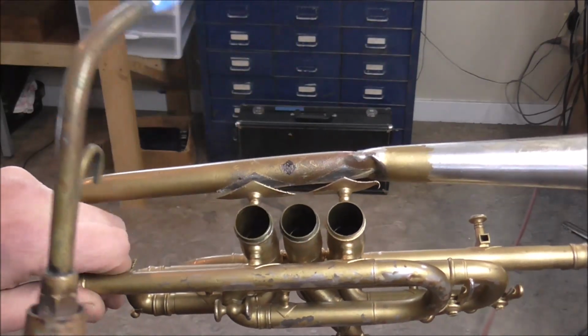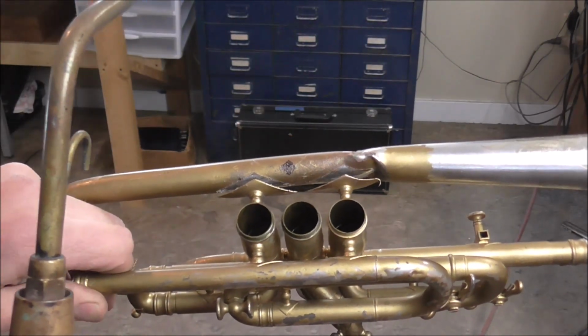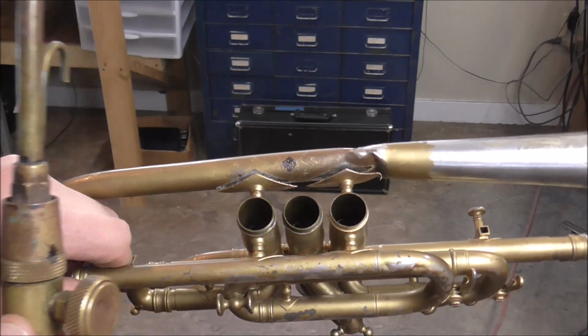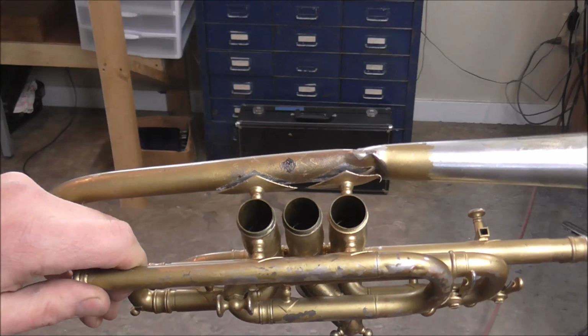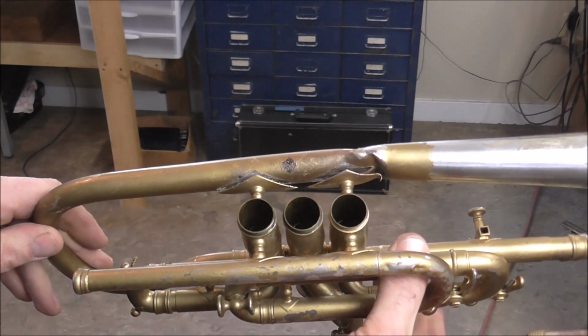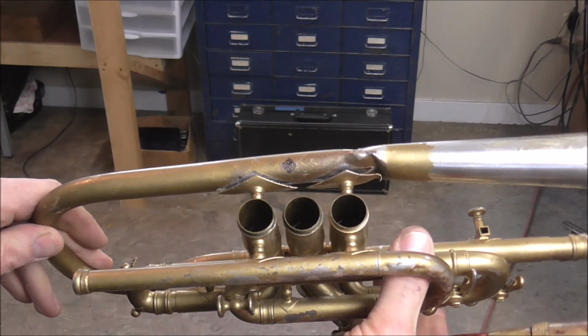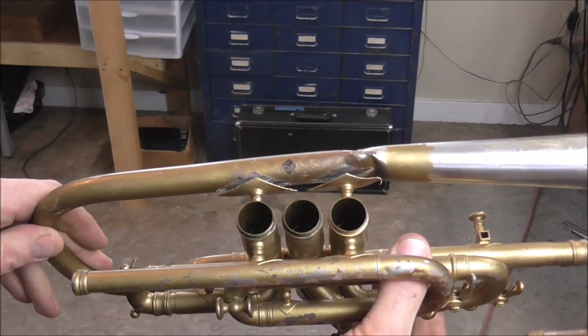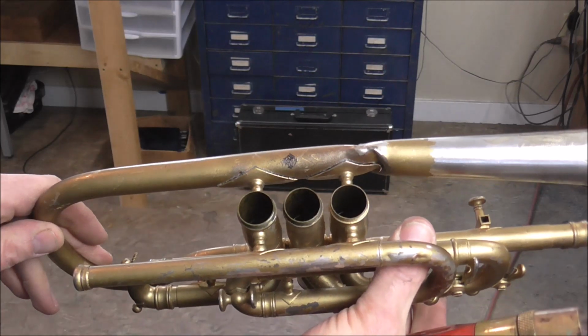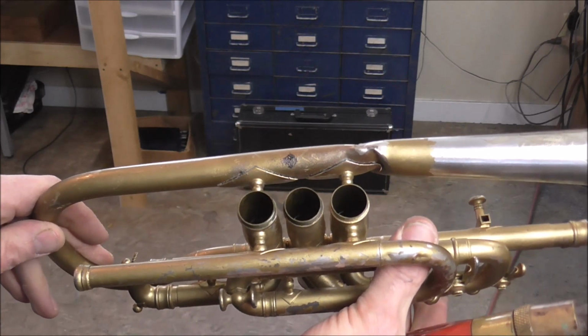And I'm moving this so that when the solder hardens, it does not stick back to there. And there, it should be hardened by now. It usually only takes a couple seconds for that solder to harden. The way you do it is when you get up to 450 degrees, this pops off. And then if you keep it like that, then when it cools back down to colder than 450 degrees, the solder will be hard, and then you can touch it without it sticking back together.